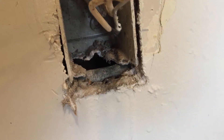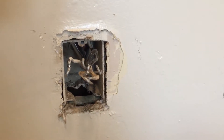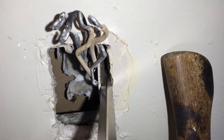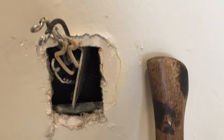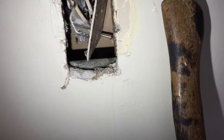I'm starting to break the box apart with my channel locks. There's a piece of copper pipe — got to be careful, that's live and full of water. There's a shelf right next to it. Probably feeds the bathroom since it's on the wet wall by the telephone junction — probably feeds the bathroom toilet. I found a nail on the bottom and what looks like a stud on this side. The nail is right here in the thick part — yep, there it is. There's a nail on top too. Got the box out, now I've got to pull the wiring.